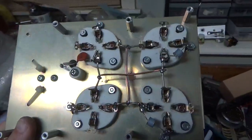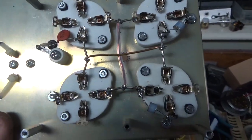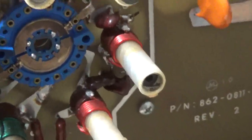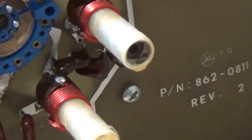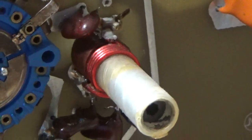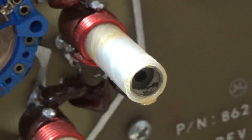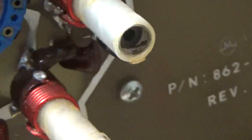I grounded the grid connection right to the metal, one per tube socket. I had to replace the leads. Now I know why they messed with the rear board — looks like someone messed with the 10 meter input circuit. There are two micas in series below it, and then one that isn't even connected on top of it. I'm guessing the person before the customer was a CB-er, because I know the customer's not a CB-er. And this whole thing with the tank coil makes sense now too, even though they didn't do it right. I'm going to get back to work.